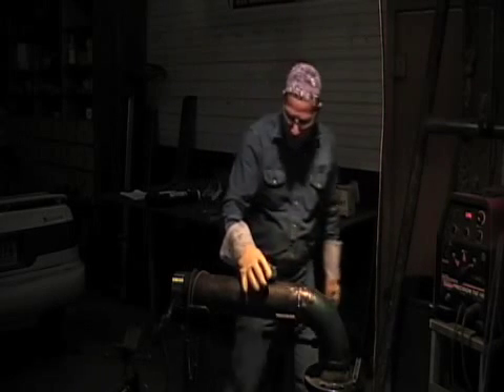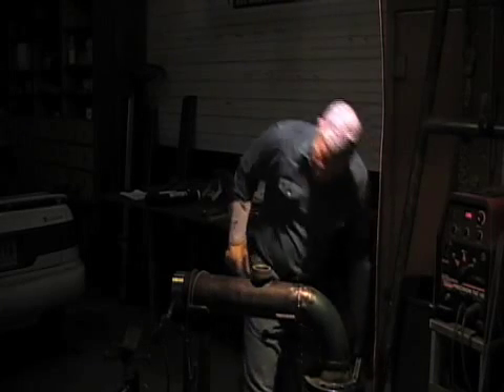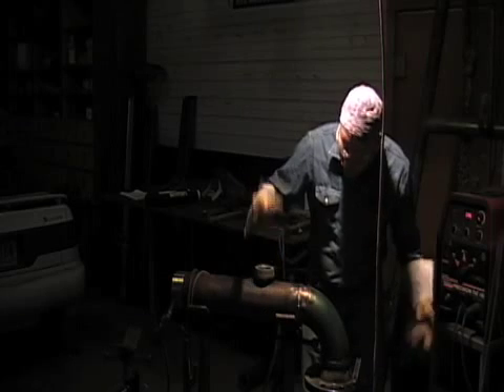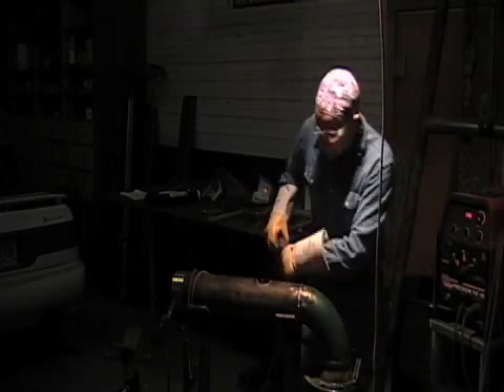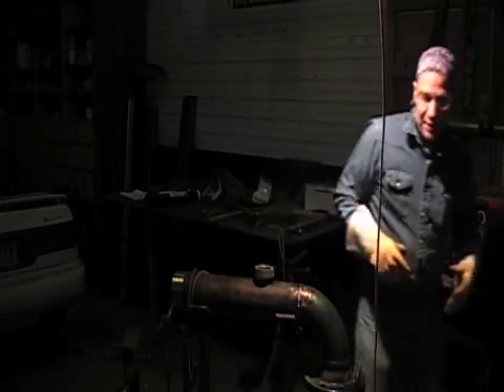Alright, I believe that's going to do it. You see that other fitting would not fit properly — that's a perfect fit, it's a good cut. Some companies want you to seat this thing with a gap; they're not worried about it, and I'm not going to worry about it either. But a lot of times you would have to put a full bead penetration. I've been in refineries where they require that, and believe it or not, sometimes they will come out and shoot one of these with an x-ray. That's all we've got time for today. I'm in the dark, but you're not because you're behind the welder's lens. See you next time.